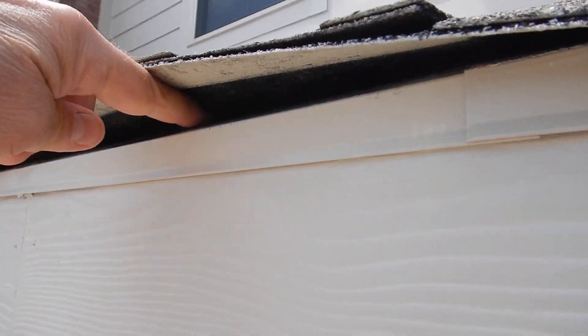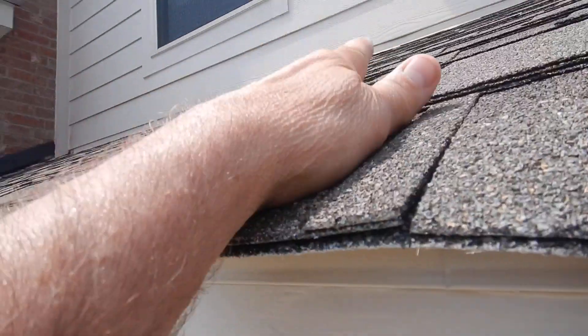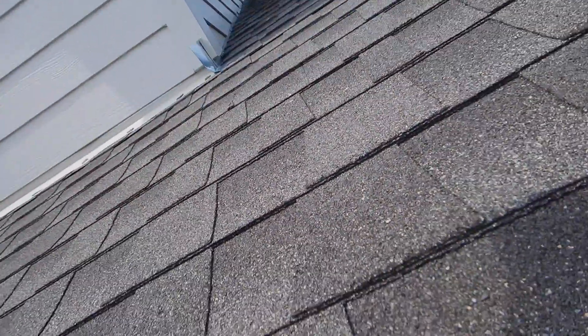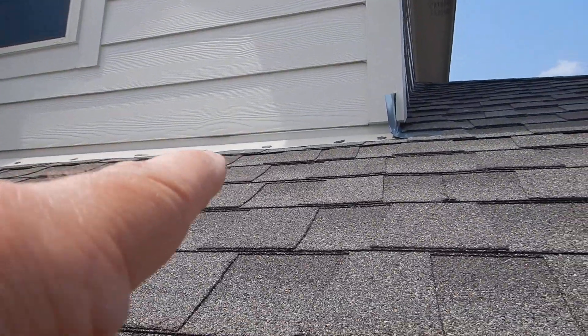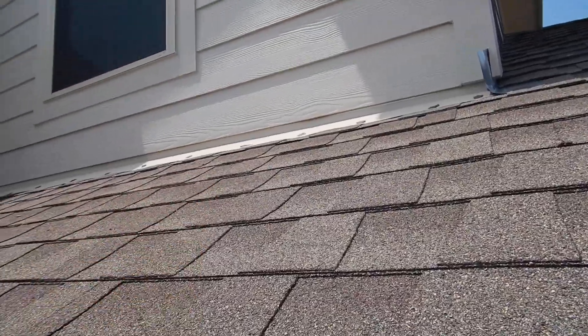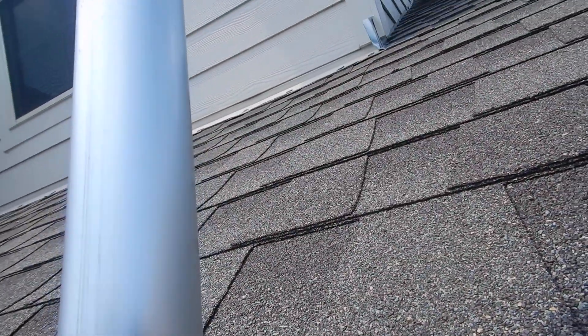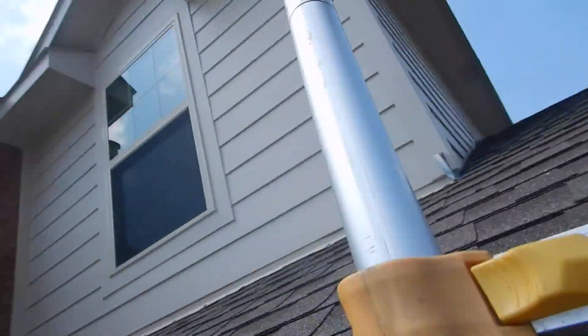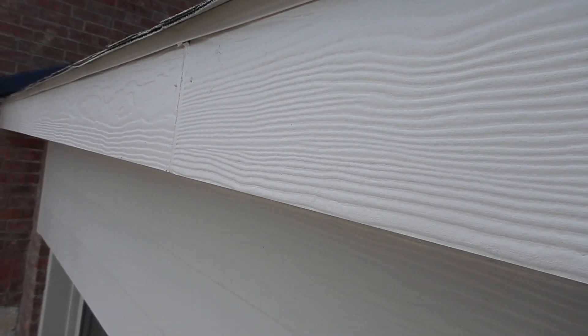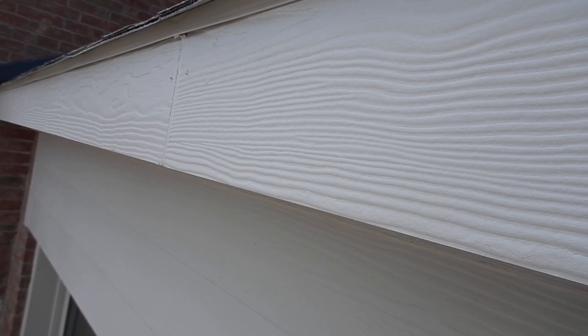If I'm not seeing a starter — of course I never do. I don't know if the camera can pick this up, but these shingles cascade down. The siding cascades down over the apron flashing, the apron flashing cascades down over the shingles, and the shingles cascade down over one another. The shingles are supposed to hang out — I'll measure that — but they don't seem like they're overhanging quite enough.